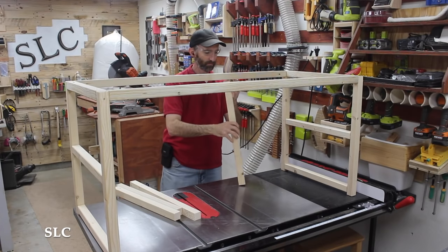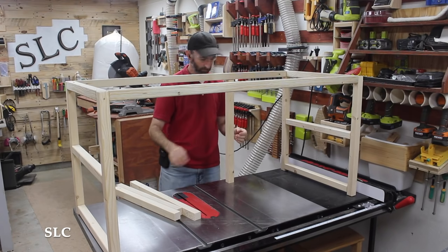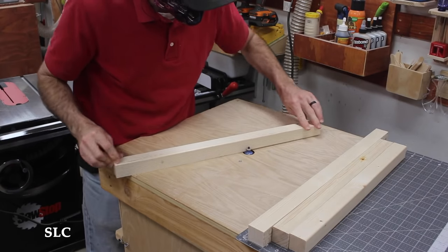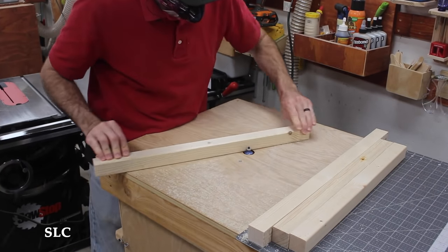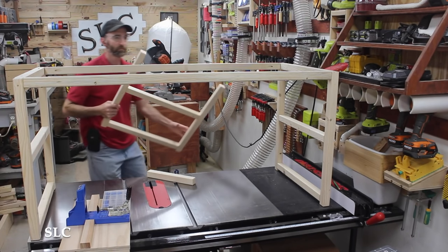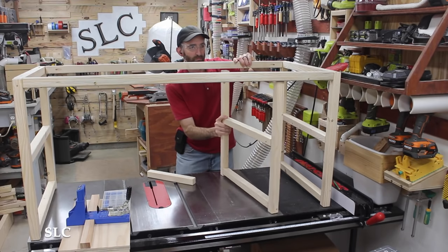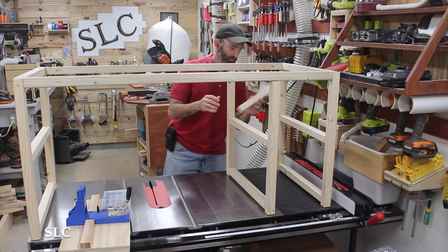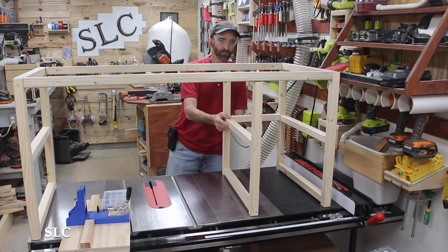Considering the floor in my workshop is not exactly level, I moved the frame over to my table saw, which was probably the flattest surface in my workshop. After a quick measurement, I took the middle set of legs over to be smoothed down and assembled with the same pocket screw process as before. When I went to add pocket screws to the inside of the middle legs, I realized I should have added them before the center support. So instead, I added them to one of the sides and planned to use a plug to cover them up later. I also prepared a rear support to give additional strength to the middle legs.